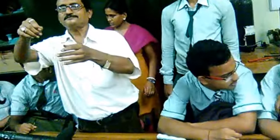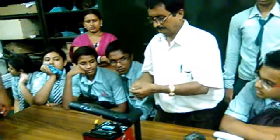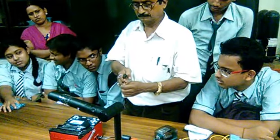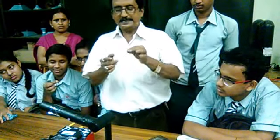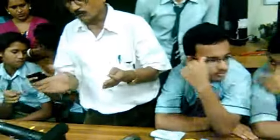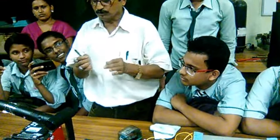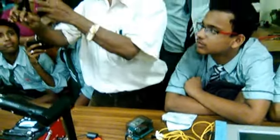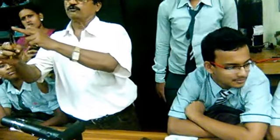Here, this is one fiber. I will join it. Joining of optic fiber is called splicing. Optic fiber has one coating — color coating. Color coating means there are so many fibers; by color we can distinguish one from another. Before splicing, we should have to remove the primary buffer, actually color coating, from fiber. I am removing primary buffer or color coating by this instrument. This is called a stripper. The stripper has a 125 micrometer hole.